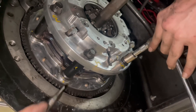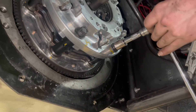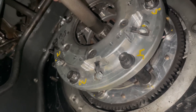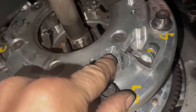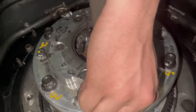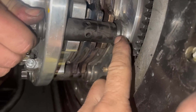We are at the clutch. I've got to break all these free and turn the stands a little bit. This clutch has got these little holes and we're turning them in right now, adjusting the air gap. Steven's going to turn those in, torque the plate again, come in with the indicator, get to zero — and that'll be where we start.